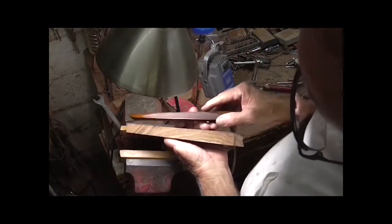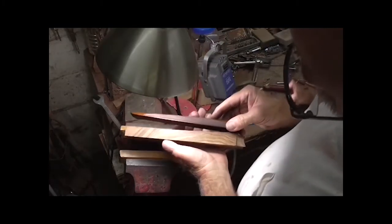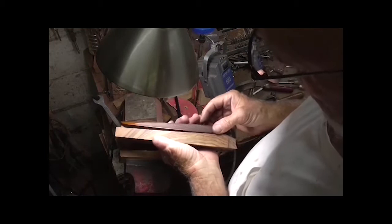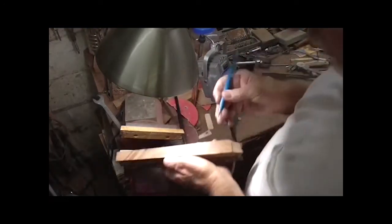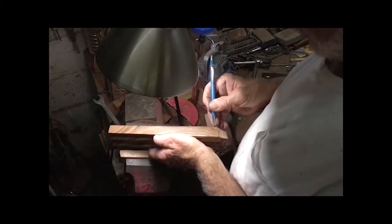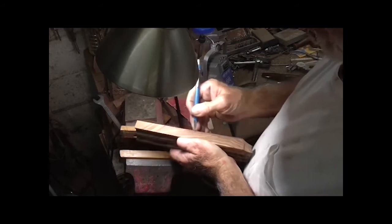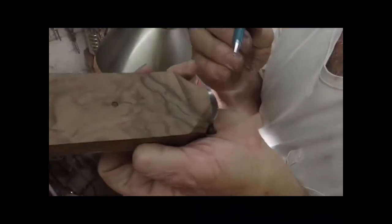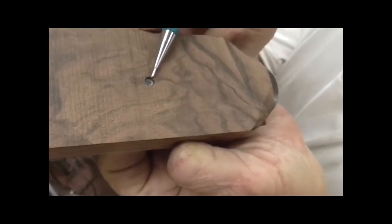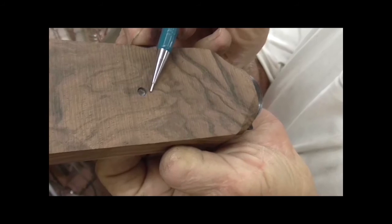And there again, that's also on a taper — it's thicker back here than it is right there. So I've got to approach this thing really carefully. Well, it looks like that's about right, but it's a scary thing. There's no do-overs when it comes to stuff like this. I'm going to take about a sixteenth less than that 0.213, and just cut that off with a bandsaw to start with. You can see where that screw head is — it's just a little bit, like a 32nd, below that surface.